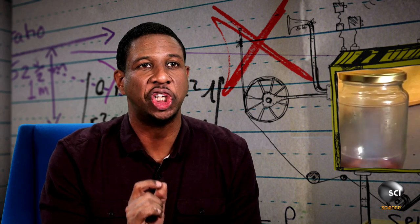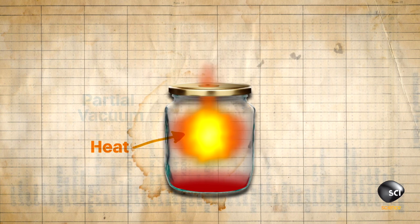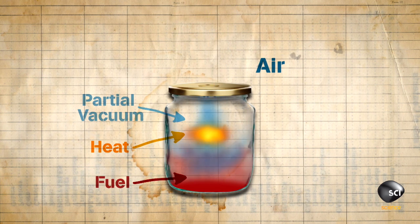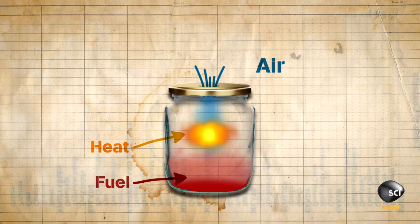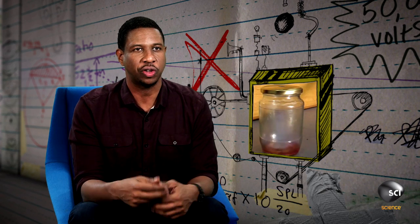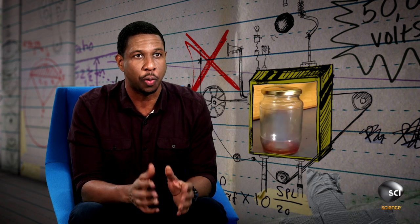When the pulse happens, gas is ejected out of the jar and this means there's a partial vacuum in the jar. This partial vacuum leads to more of the fuel evaporating and also leads to more air being sucked into the jar. When the fuel and the oxygen from the air flowing in mix, they use the heat from the previous pulse and that causes a second pulse to light up. This process will continue happening over and over, as long as there's fuel or for as long as the engine can sustain the heat and the pressure.